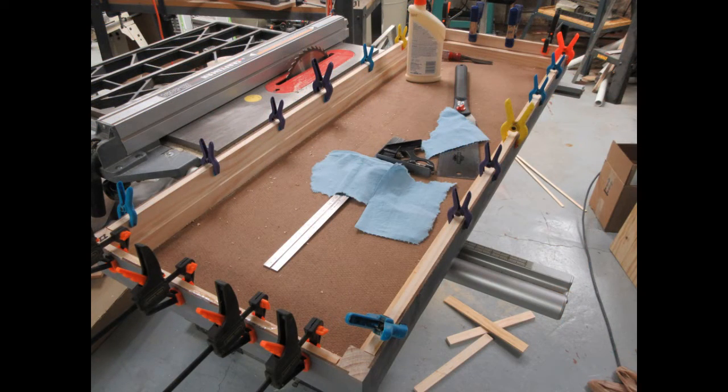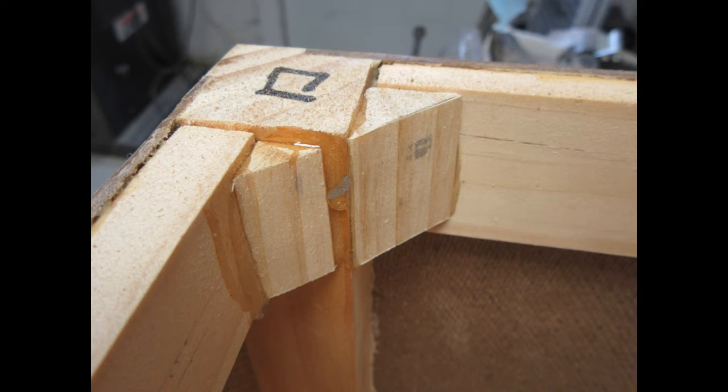The valance strips can then be attached to these thin wood strips because they are thick enough to take the screws that will hold the valances on. Although not strictly necessary, I like to add fillets of wood to provide extra support for the ends of these thin wood strips so they can better transfer stresses to the frame. These are bonded to the case using epoxy.